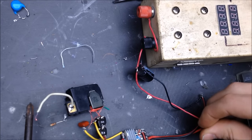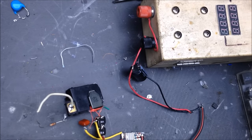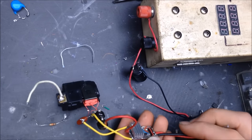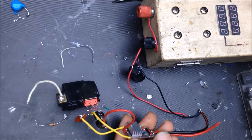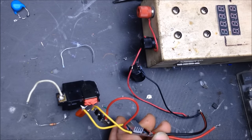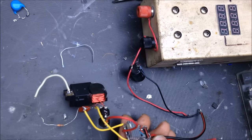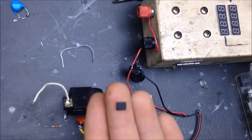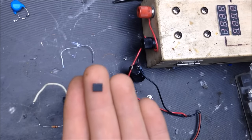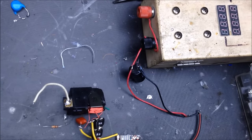Absolutely. So, obviously this little power supply has some issues, mostly overheating, still in the MOSFETs, mostly because I don't have a direct contact between the bottom pad for the drain, which is where most of the heat gets sent out, and the heat sink. So, effectively, all the plastic on the top here is acting like an insulating barrier, so I can't really get rid of the heat, plus that heat sink is rather small.